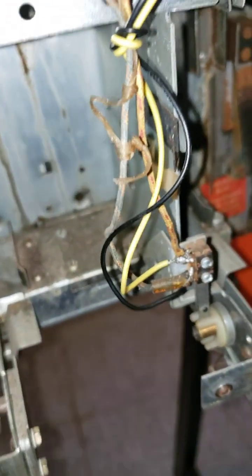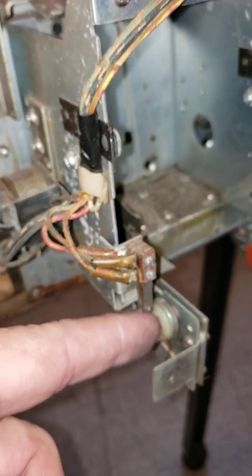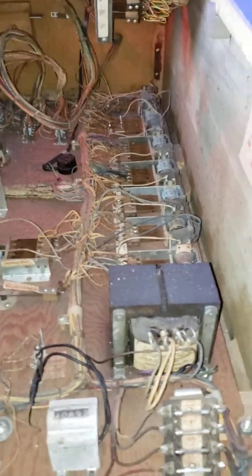That's usually what happens with these — you just never know. We have coinage, and we're going to be putting a little coin slide in there since it's missing, which will be kind of neat. We can also put these machines on free play — that's a whole other video, but you do a little bit of work in the back box. Always disconnect the machine before you start checking out these wires. We have a little transformer here and you need to watch for correct voltage — get a multimeter and check it out, make sure all your contacts are good.